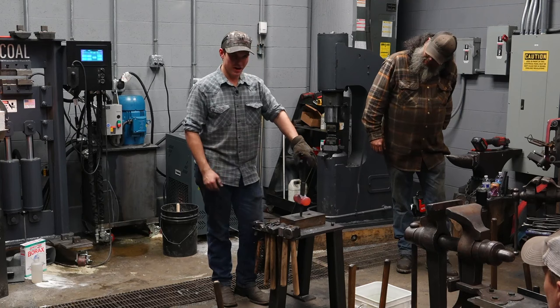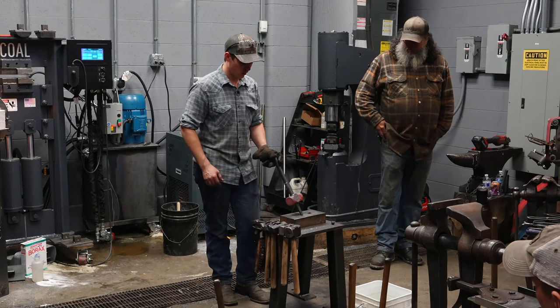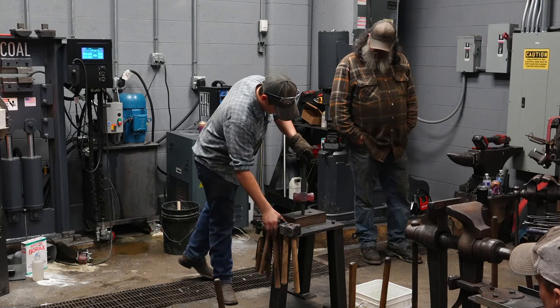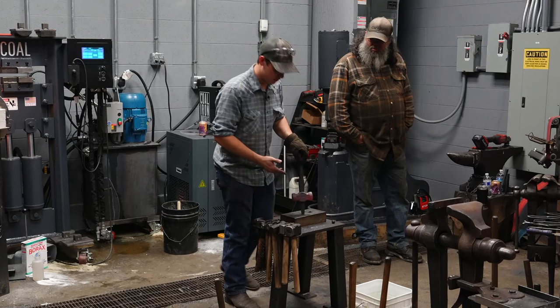So I still forge this way even though we have grinders because it saves money on belts. And I like to see that I can forge that to the point where I could take my rasp and finish it in the vise and use it. I don't need to grind it. Like with this hammer eye punch, it wasn't ground, it's completely forged. Like the inside of this ball fuller, try to find me a good way to grind that out. You can't, but it's clean. I like to see that in forging, clean forging that's efficient.